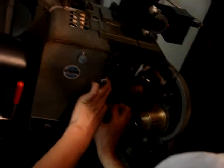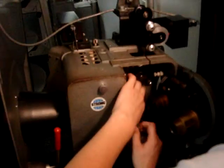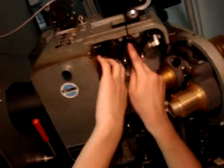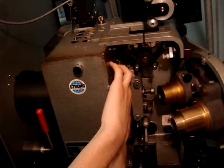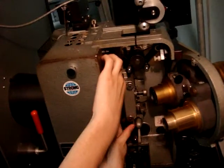There we go — it just bolts back on. And then you have to prop this up so the film is about level with the top of the sprocket, because otherwise it will just pull straight through and it's never any good. It just damages the film that way.